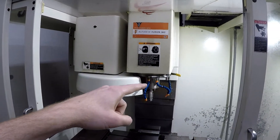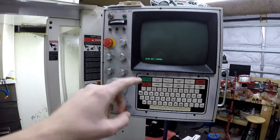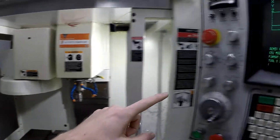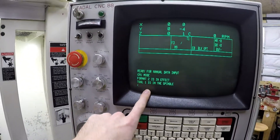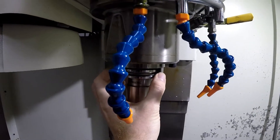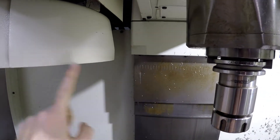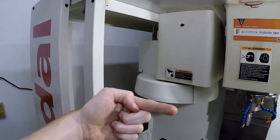I did the cold start position and then on the screen here, when you type M19 while you're in manual mode, that orients the spindle — it clocks it. So these — I feel whether I put the cleats or whatever — that spacing lines these guys up to the tabs that are in the ATC. And then I manually move this forward and do that.